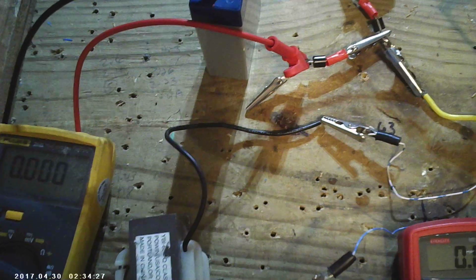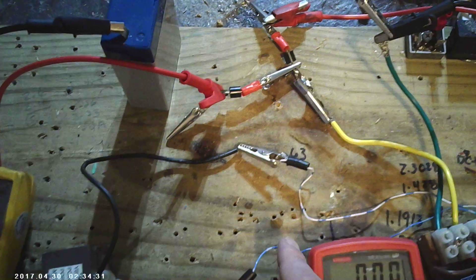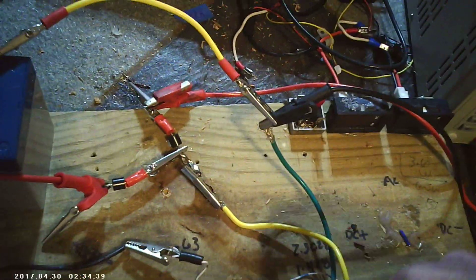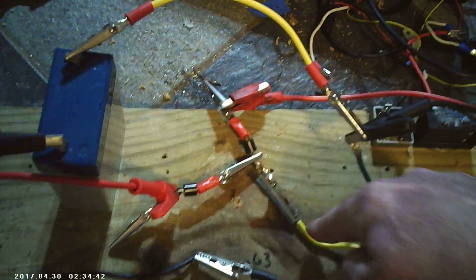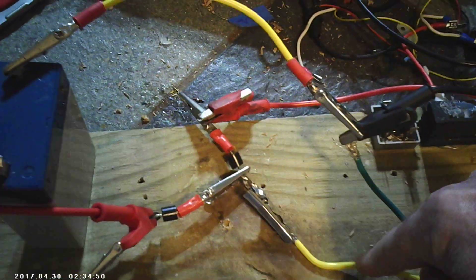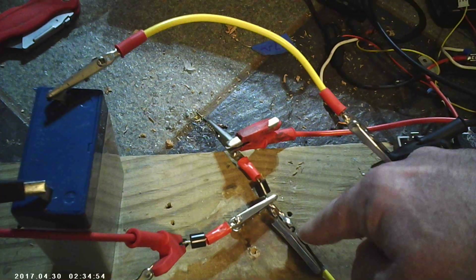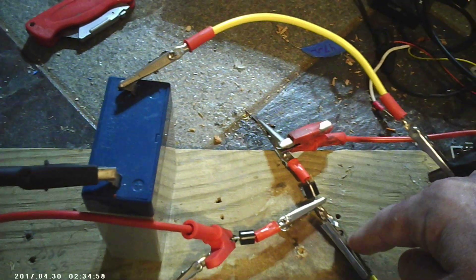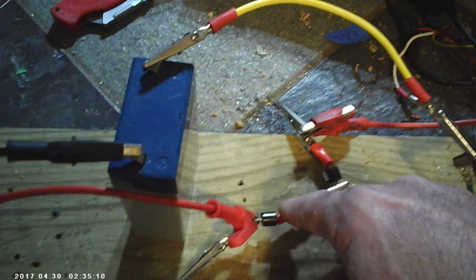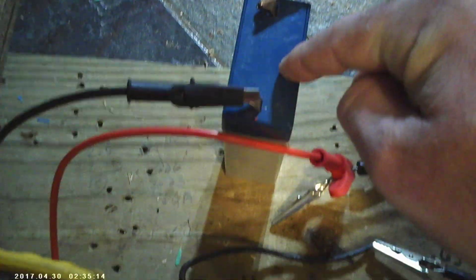This alternating direct current goes to a heavy-duty choke, which is just going to start flipping polarities and pulsing. I'm going to hold a magnet by it and we've got a strong magnetic field coming out. We're going to check AC amperage through here with a clamp meter to show that a lot of amperage is going through here. The back EMF is going to come out of the yellow, not the green — the yellow is the positive coming back to the positive. We're going to be so much higher than the battery voltage because of the inductive back EMF; the voltage raises a considerable amount, enough to flow pretty decent amperage through this way, goes through the multimeter into the battery, out of the battery, into the ground.